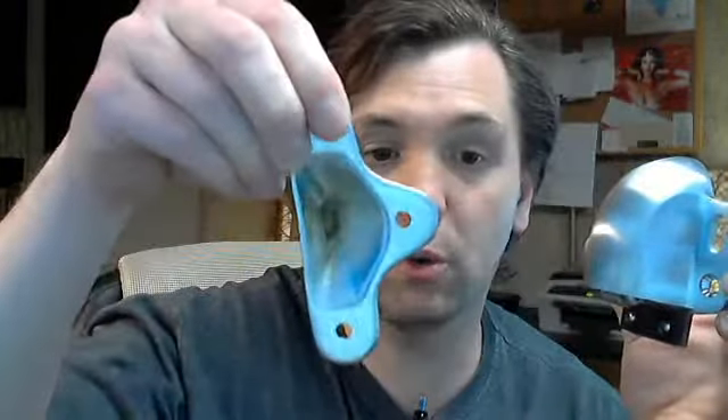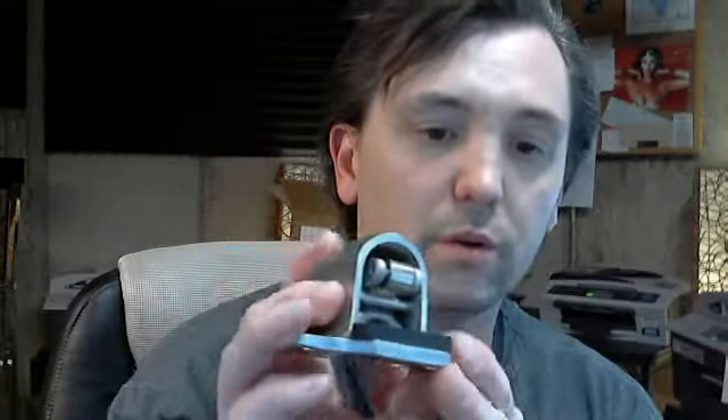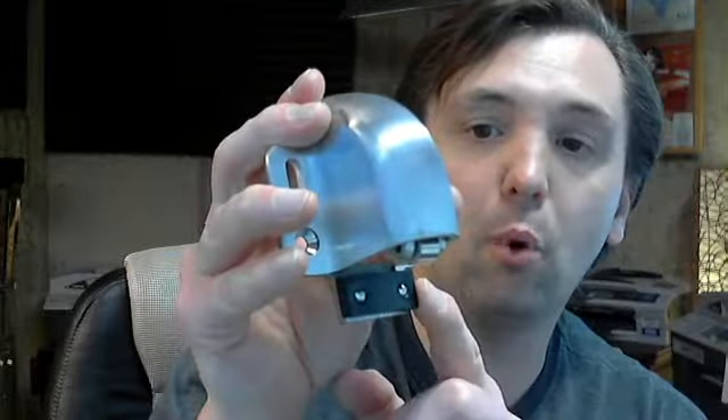This is the portion that mounts to the door. This is the portion that mounts to the floor — this is the floor strike. It's available in multiple finishes; this is the satin chrome finish I'm showing you here. There's the housing that mounts to the door. See the spring in the back here — that regulates the roller, which comes in contact below. I can just barely depress it by hand. And there's a rubberized stop, which is where the stop portion comes in.